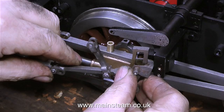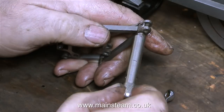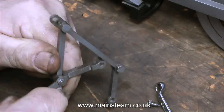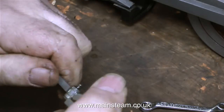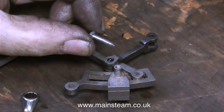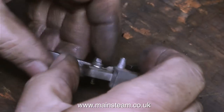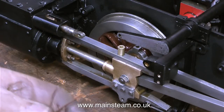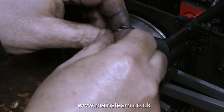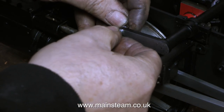But there's a bit of a problem — if you look at this, the pins are fitted the wrong way round on this side, so I'm going to take them out and put them in the right way round. Everything was going quite well until I found that one of these pins was fully seized up in the hole. How difficult can it be getting this out? Well, it turned out to be very difficult, because these are small parts and you can't just hammer them out otherwise you're going to bend them. But finally, with an absolute minimum of ultraviolence, I got the pin out. I'm fighting the urge to just use an ordinary 4BA bolt — you must never, ever, ever do that. I always make pins, because threads do not make a good bearing surface for this job at all. So I just made a new pin in the lathe — it was a very quick job. Once again using the small oil can with a specially extended spout, I'm lubricating all of the parts. All of the pins are a very, very good fit with no slop at all, which just reaffirms my theory that this engine has not done much running.